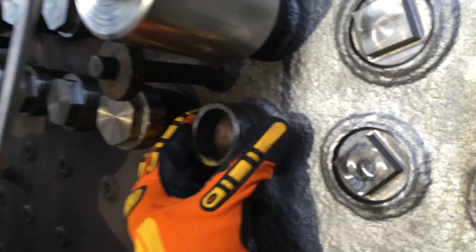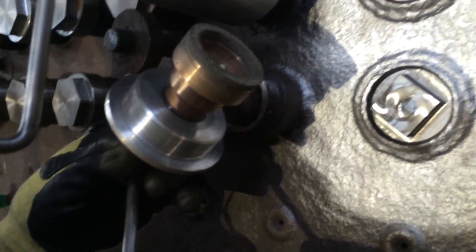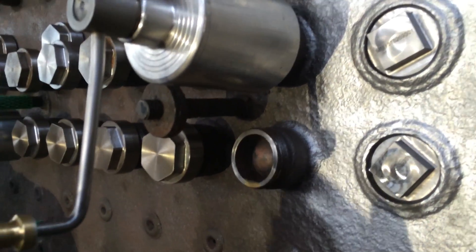Once the thread surfaces are known to be in good condition, we address the gasket seating surface, and that involves a variety of different tools. There's a heavy layer of corrosion and oxidation on that seating surface, and in order to avoid dulling our cutter, we designed a special style of stone that was epoxied to a custom-made tool that fits within the tool arrangement. That could then be operated against the corrosion surface to remove that hard surface, and then we apply the cutter.